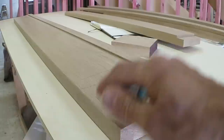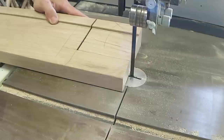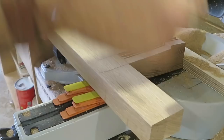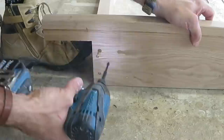Typically horns are often cut by builders on site, but I was able to do it beforehand because I knew exactly what was going to happen. I knew where the cladding was going to be, so I got the horns cut and then I can make the little rebates here for the jamb to come down and sit onto the sill.